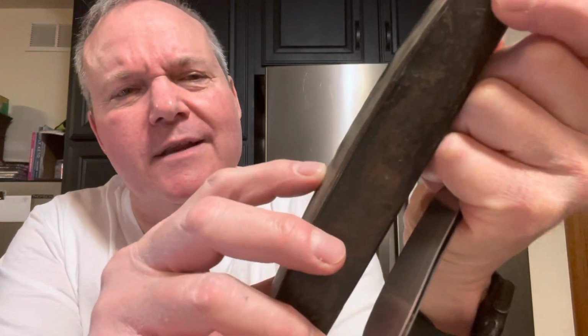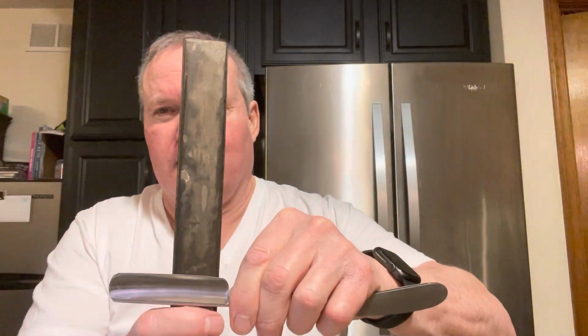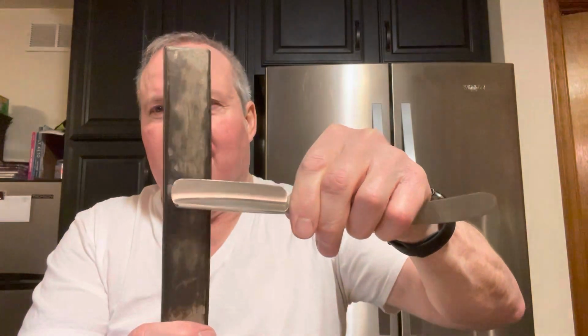Now there's no oil on there, and this is rough. It looks like it had been patched and hacked up. So this is not something that I could ever use and get effective results on, but it does look used, and it does look like somebody may have gotten effective results on it. So you're going to do a motion like that, perpendicular to there, and cut a back bevel, very similar to the method that I use, and the method described in the German Grinder's Handbook, the published English interpretation courtesy of that great gentleman from Norway, JPO.